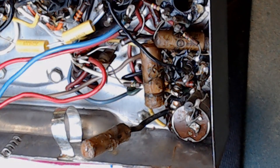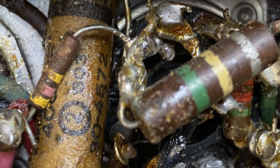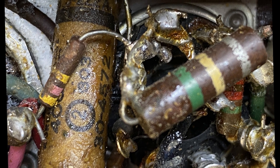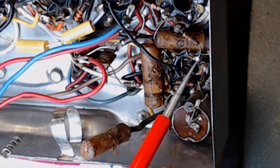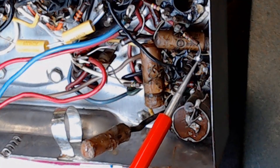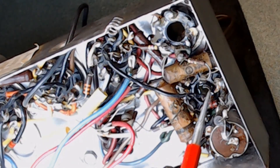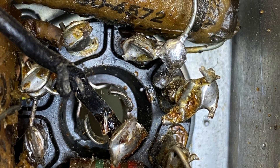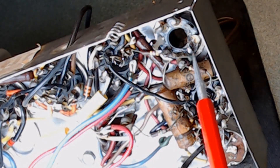All right, the more I dig into this the more problems I find. What I did — I cut one side of this resistor which was right here. You can see the solder here from whoever worked on this before — they did an awful job soldering. All the resistors are very old, and somebody worked on this. You see all the solder here; it's pretty loose and it was hitting this pin. It's just a big glob of solder right here.